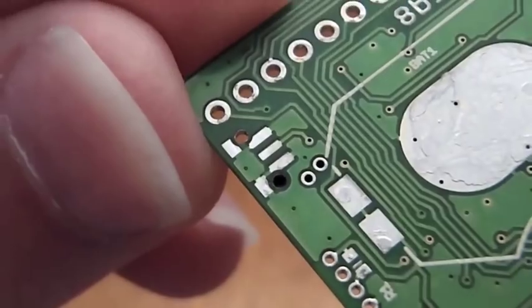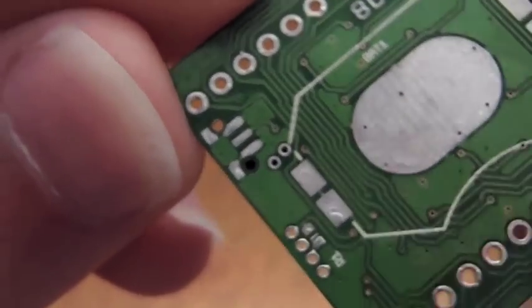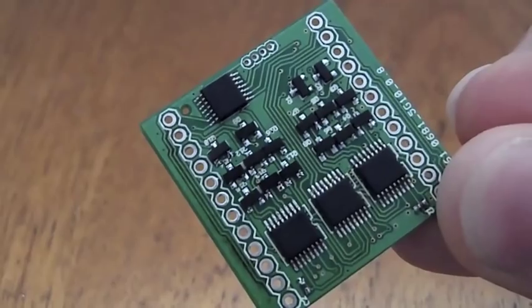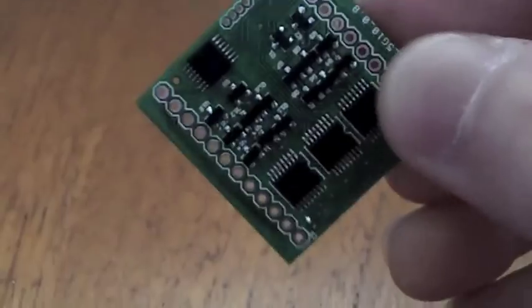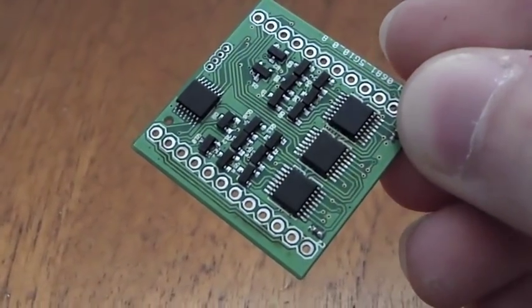As well as the button on the back, two external pins from the MSP microcontroller were brought out, in case you want to install your own watch crystal for accurate timekeeping. Even though this design features dozens of components, the unique component count is only 7, and all the components are sourced cheaply, reducing the total bill of materials.